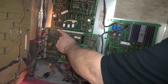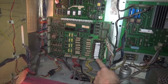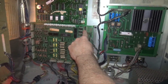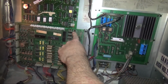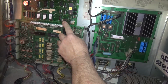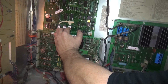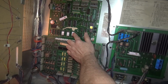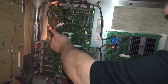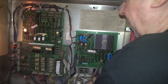Now, we put all new connectors here, and we put all new resistors here. And right here, we have the most important thing. We have the 0 ohm diodes, or wires, so the switches are the most sensitive they can be. We have 3 new EPROMs for this game. So 3 fresh ones have just been burned. See our button battery, which the customer can change in 3 to 5 years whenever it goes bad.